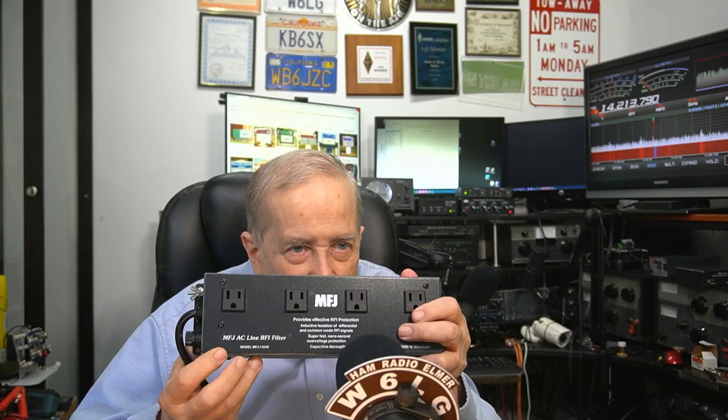In this one, they're both vertical, which is 15 amps. The cord is 15 amps. The fuse is 30 amps. A 30-amp fuse protecting a 15-amp cord. It also says the implication is that these are 25-amp outlets — they're not. They're standard 15-amp outlets. It says 25 amps, but the cord is 15 amps, the plug is 15 amps, and the fuse is 30 amps.